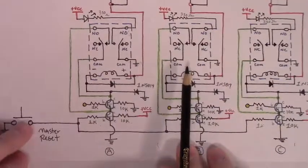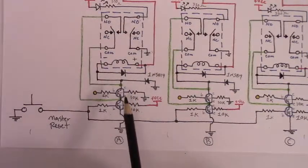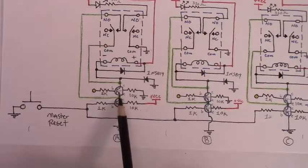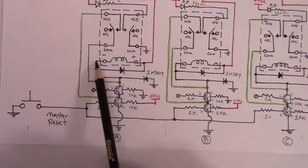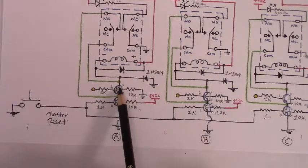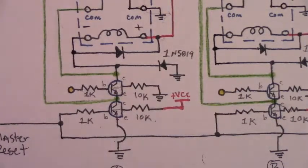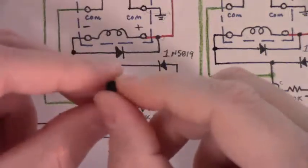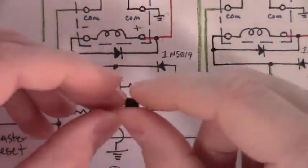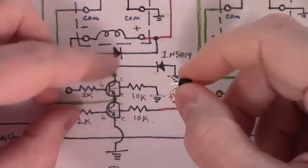We have to add the control lines. To take care of what's left on this schematic, the first thing we can do is add in these NPN transistors and run a wire from the negative side of the coil to the collector of that first NPN. These two NPNs are in series. The particular NPNs I'm using have the flat side pointed to the right-hand side of the board. As with PNPs, you can test to find out the orientation of the collector and the emitter.